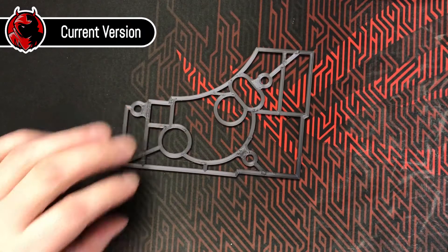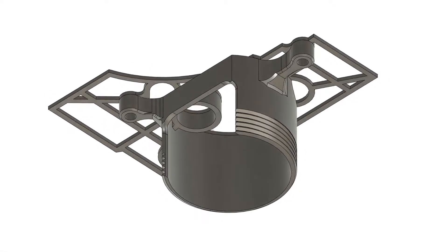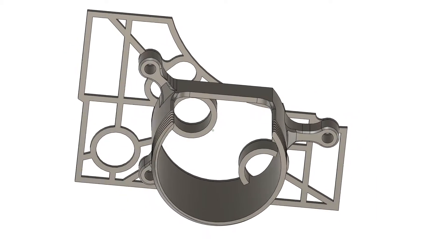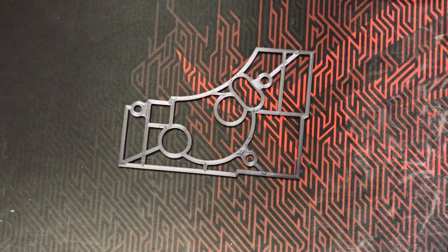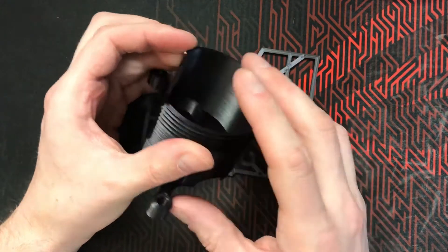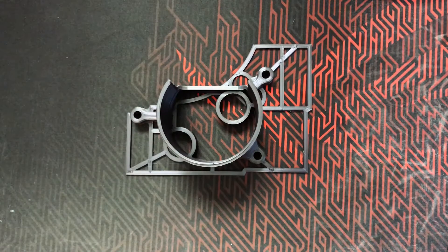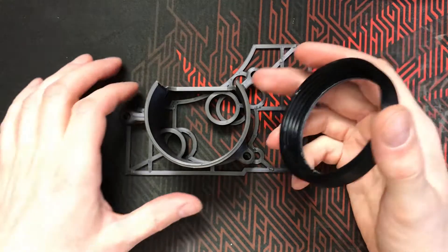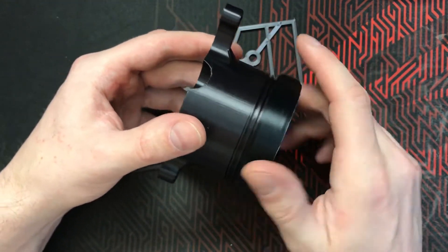This is what I made instead: a 2mm thick base plate, because I only needed to raise the bracket above those case elements. I made the bracket smaller and designed round elements inside the bracket to keep the reservoir on top of the case lid stand. The printed part came out pretty nice — I was happy with the print quality and the printing time. The ring for the bracket fitted nicely with only a 0.1mm offset.